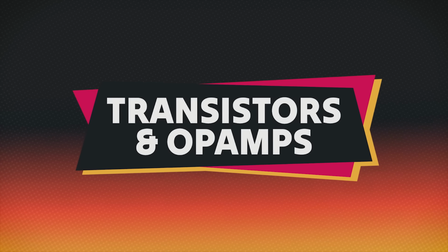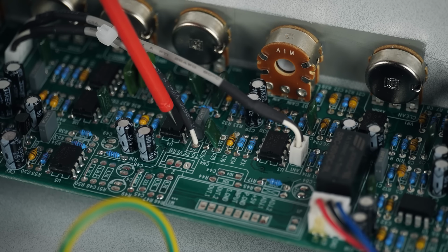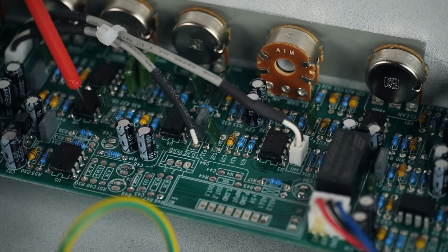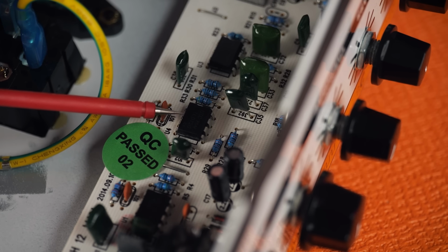If you haven't experienced an analogue amplifier before, these are a really great entry point because not only are they affordable, but they can get surprisingly close to the playing experience of their bigger brothers. Op-amp-based gain staging makes a lot of sense when you want to create a reliable analogue amplifier that is still representative of the bigger valve amps, where the main objective is keeping the manufacturing simple and the retail price as low as possible. Tone is not in the components, but in the circuit.